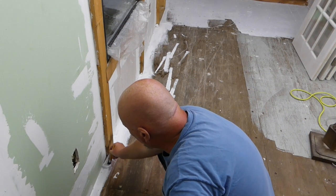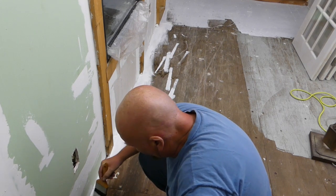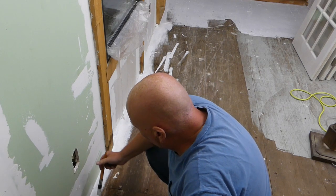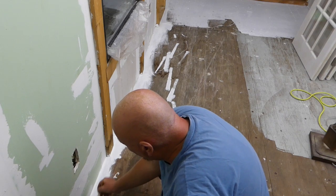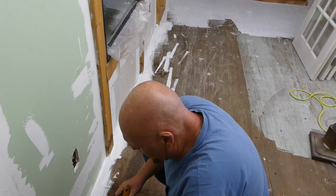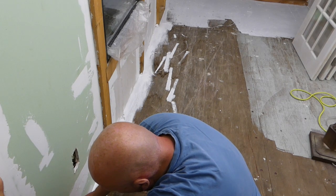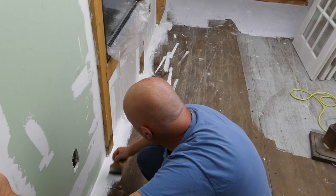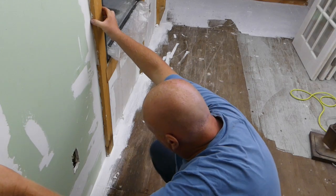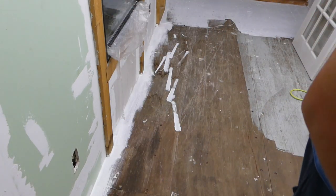The floor is pretty porous, so I don't know how far this paint will actually get. The paint is not a final coating. This is just a primer to seal the floor so I won't have any vapors and no scent coming through. But the tile and the flooring system will be put in later. I still have some drywall to do. So I'll be doing drywall and a final coat and sanding. So this will get kind of messy.